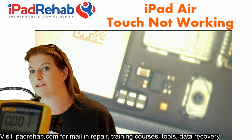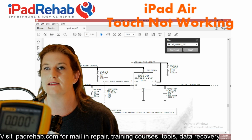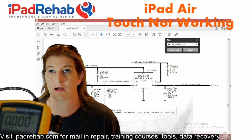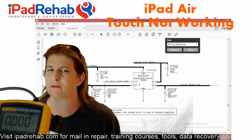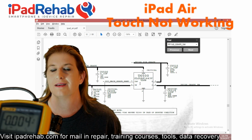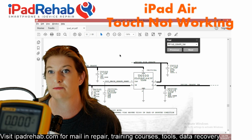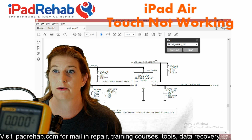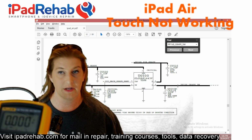So we're going to go back to the schematic. All right, so we're missing this. C6510 is a big old goose egg right now. So let's find out why. Is this chip not working? Well, before we can point a finger, hey bro, change U6500, 100% tested working, let's first ask, is he being told to turn on, and does he himself have power, and does he have this upper line that it looks like he's going to send through. So let's see what we have and don't have.